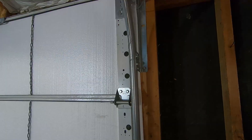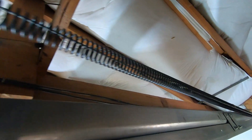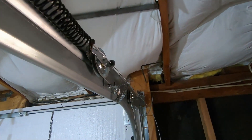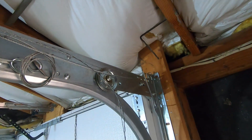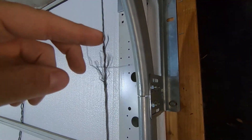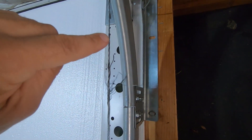This is an older style spring — even though this door doesn't look very old, you can see it's quite modern, just not typically used this way. There's the attachment point for the spring, which comes all the way forward to a pulley. You can see this is the one I've got to replace. I'll open the door to release the tension on the spring so we can safely replace this cable. Not good — you won't want to let it get that far. It'll show you signs way earlier, with the cable frayed and flapping in the breeze.